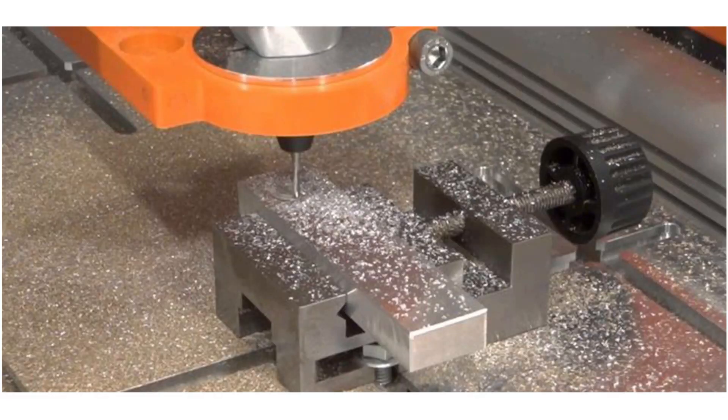If you're cutting a thicker piece of aluminum, the deeper you make the channel, the more chance there is for chips to fall inside that channel. So it's important to have some sort of chip removal. A vacuum usually doesn't work — we recommend using compressed air with a flexible nozzle connected to an air compressor to blow the chips out of the way.